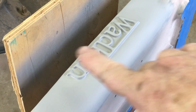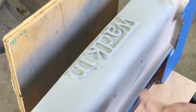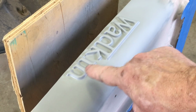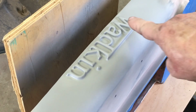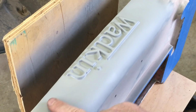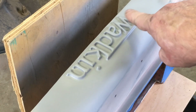Anybody that's working with cast iron, and especially letters that you're trying to smooth out, I've done Bondo work and stuff, but usually what happens in casting letters is the sand particles deteriorate, and these castings can be pretty raunchy. What I mean is you can smooth out as much as you want of the body here, but you'll always see the transition of the surface.